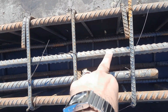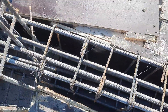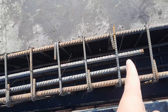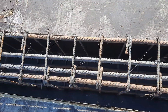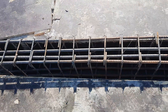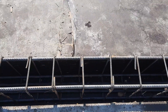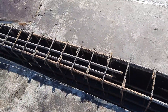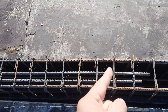If you are working on a construction site, be careful especially for these common things. Concrete cover is also very important to provide at the bottom of this beam. They didn't provide it here, and sometimes they are not able to — the concrete cover should be fixed with the steel reinforcement with the help of binding wire. Concrete cover is very important for the left side, right side, and bottom bar, and should be a minimum of 40 millimeters or 1.5 inches, especially for a commercial building.